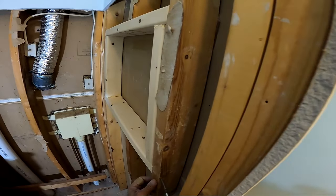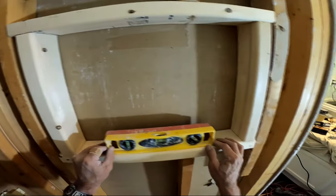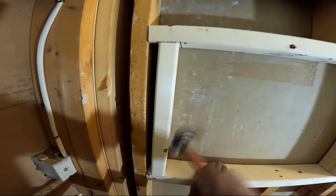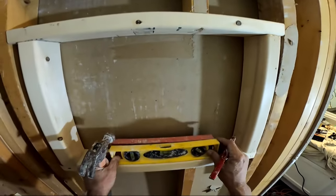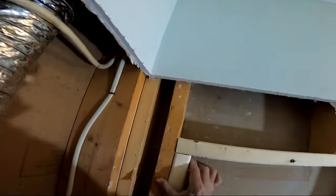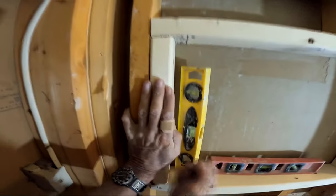A lot of people feel it needs a king, jack, and header, especially on that back wall since it's usually a load-bearing exterior wall, but framers have told me there's no harm for cutting one stud like that. I put the horizontal lateral studs in between, then figure out the math on the vertical studs I'm hammering in and leveling out to find what size they need to be.